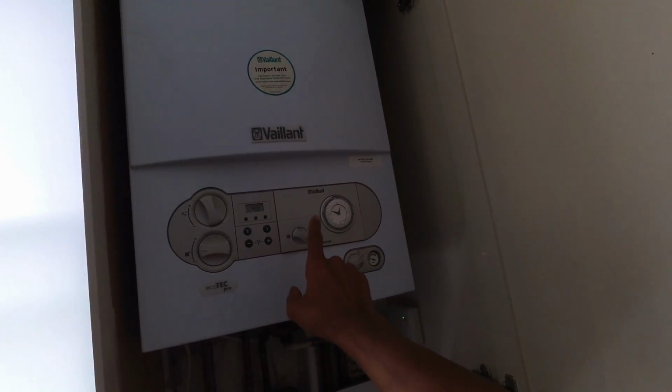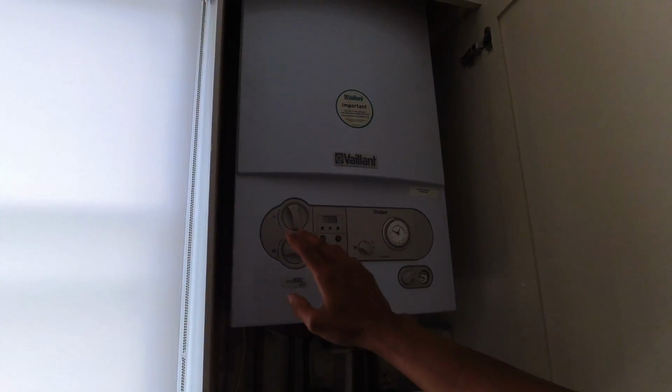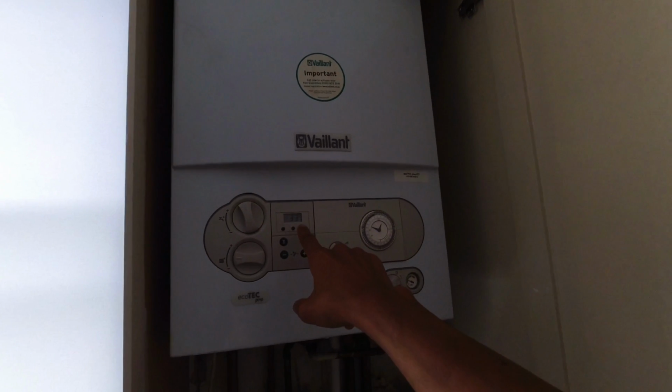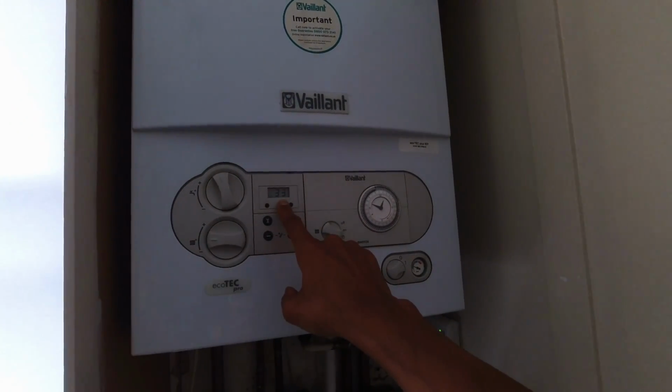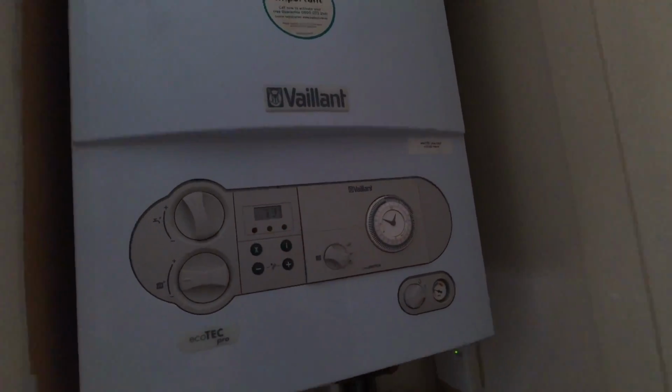Okay. Next, this was on off, and it still, for some reason, was putting the heating on. And even more recently, hang on, did we just see that number just change? Did that just jump? It may have done. I'll have to watch this video back to see if it did or not. But basically, she also said that recently it's supposed to be coming with F62. There we go, look, it's 48, 33. It's jumping all about the place. And coinciding with the fact that it's an F62 PCB, I can also hear the pump is constantly running at the moment.